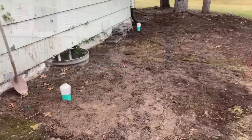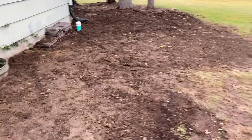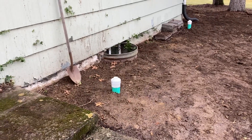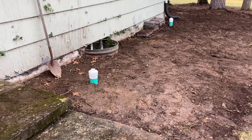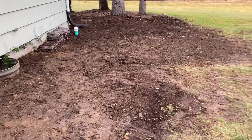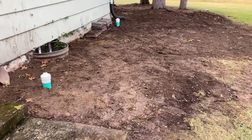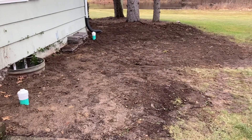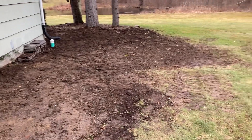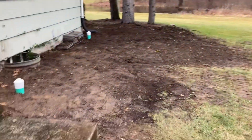Job well done. Went inside, ran all the fixtures, made sure we had good flow and we certainly do. We checked for pitch very often, making sure that when we moved one section of pipe, we checked every prior section to confirm it still had the proper fall on it. Everything is nice. We're covered back up and our friends over at Lynn Warren Landscaping are going to come back and mulch all this up, make it look pretty again. Other than those two clean-outs sticking out, it was like we were never even here. Excellent job by everybody.